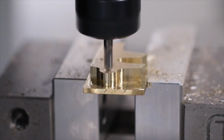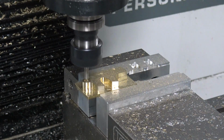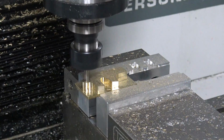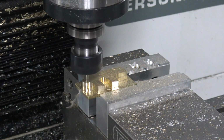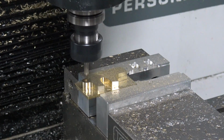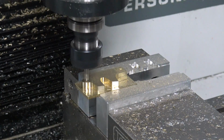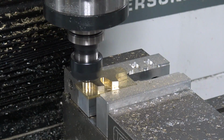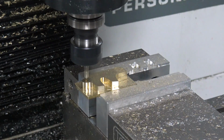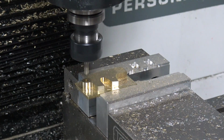So here we're going to use a 3/16 mill drill. This is actually a spotting one, which is not quite the same. The tool I want to use I just ordered from Carl over at Lakeshore. This will work. Oh, actually this will not interpolate. We'll see if it could be a problem here. Might. Let's see what happens. We might crash it. We might crash here, in full disclosure.